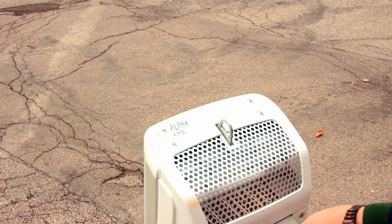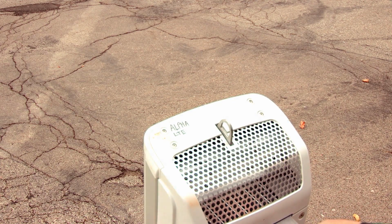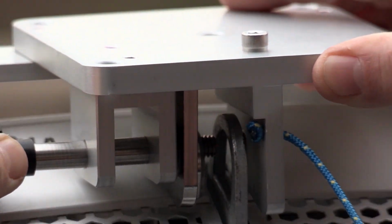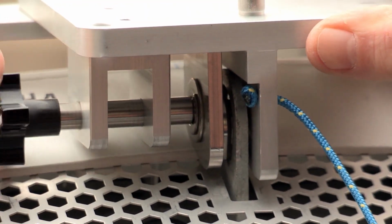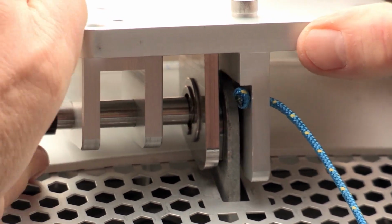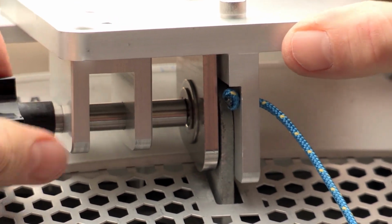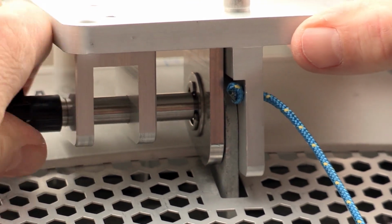To attach the Air 21 bracket, first attach its tether to the structure. Then place the bracket over the top of the antenna and open the screw knob so that the lifting ring can be clamped. Once the bracket is seated squarely on the antenna, start screwing the bolt in until the clamping plate is tight. The bracket should be firmly attached to the antenna.